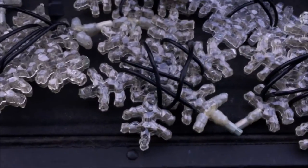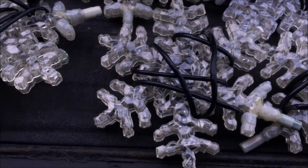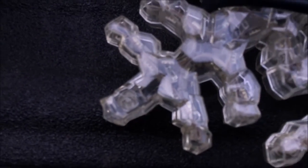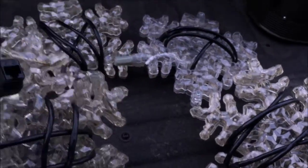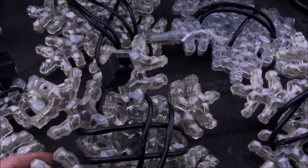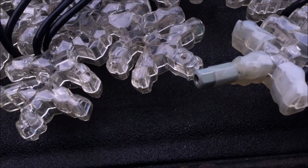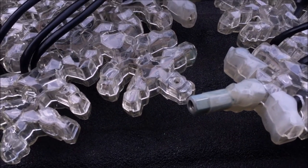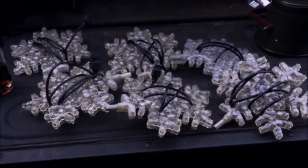These snowflakes come on top of the trees. I got the plastic at Costco several years ago — they're getting to be end of life because the plastic has been in the sun too long. But inside I've got almost nine feet of dumb RGB strip, 60 per meter, folded in and out of every tip of those snowflakes. These things look awesome. The pigtails come out to a female Cat5 connector — actually an IDC punch-down — potted in and heat-shrunk. That's what connects up to those RGB amps I'm using as DC-SSRs. On the bottom there's a carriage bolt embedded in hot glue with an all-thread coupler coming out the bottom, so it screws right onto that quarter-inch bolt on top of the trees. A couple layers of heat shrink on top for stability. Six of those for my six trees.